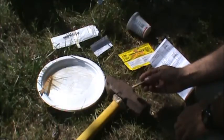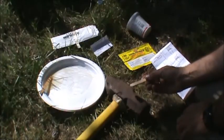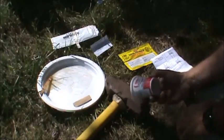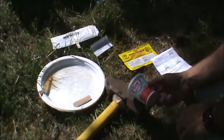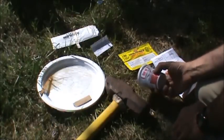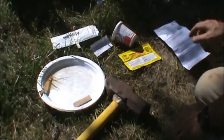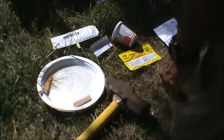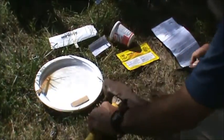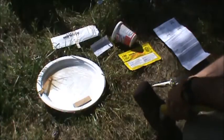They tell you to seal that bottom part, that's so the epoxy won't run out, with this little bit of putty. And there isn't enough putty there to really seal this. What you see here, I had a little jar of plumber's putty, and I've used this on other projects. This stuff is about $1 at the home center. Sometimes you can find it at a garage or estate sale. You can find a big tub of it. If you have a friend that's a plumber, they'll probably give you some. You just throw it in a bag, and it's kind of like Play-Doh, but it never really hardens. I believe it's a kind of clay that's grease-based. You can see it's pretty soft, and after I put that on there, I just molded it to the bottom and really tapped it on there.